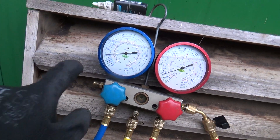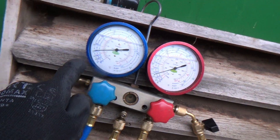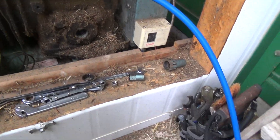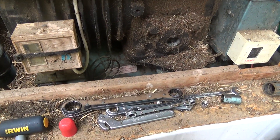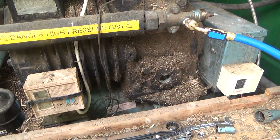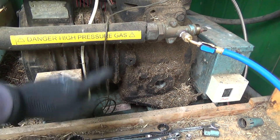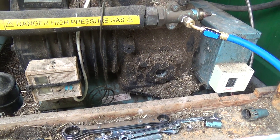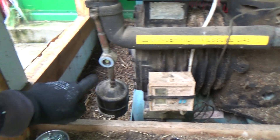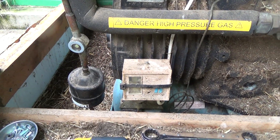Just took the LP click at about 7 or 8 PSI, so we know it hasn't sucked any air in or anything. We're just going to replace that and get it working as quick as possible because the milk's warm. We haven't got time to be messing about changing the dryer.